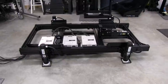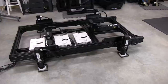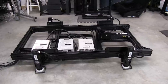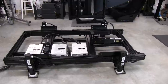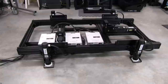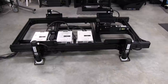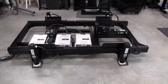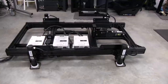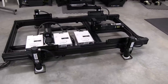Let's take a quick tour of the bottom-most part of this V4 chassis — I'm calling this the Motor Controller Slider Assembly, because that's where everything happens. This is where all the motion is, and it also has the sliding rails that give us the surge capacity for this whole cockpit. We've got four D-Box actuators — this is a 4250 set, and these are Gen 2s. That means four actuators capable of 250 pounds each, with one and a half inches of travel, which is the basic entry-level set from D-Box.